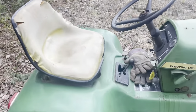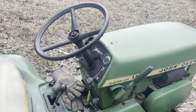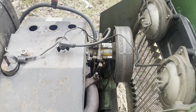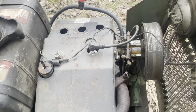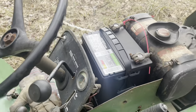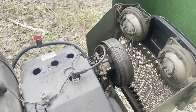This is a really, really nice tractor in my opinion — it's my favorite at the moment, which is probably going to change Wednesday when I get a new one. Under the hood we've got a 12 horsepower Kohler K301. I just ordered a brand new carb for it — it needed a carb and new fuel lines, a brand new battery, points cleaned, new spark plug. New carb is on the way — that's the one that was in the Cub. I also put a coil on it while troubleshooting, but I think both coils work so I'll need to swap those back.